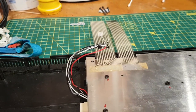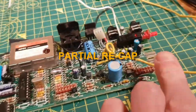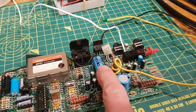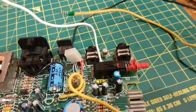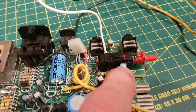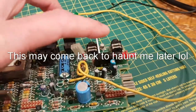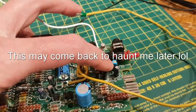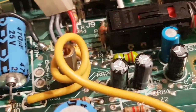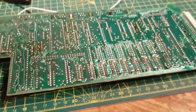By the magic of YouTube the recap is done. I went along all of these, checked them, took them all off. These were bang on, this was bang on, this was bang on. This one wasn't - it's 0.3 of a microfarad at 50 volts and I don't have any replacements. It was maybe 30% out of spec and I think it's only doing something with the data port, so I put it back. All the others have been redone.